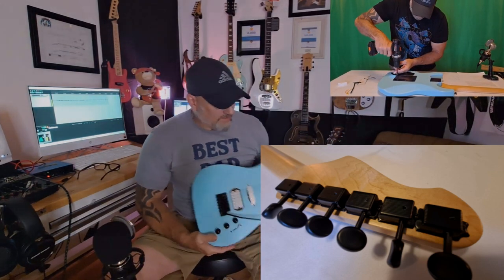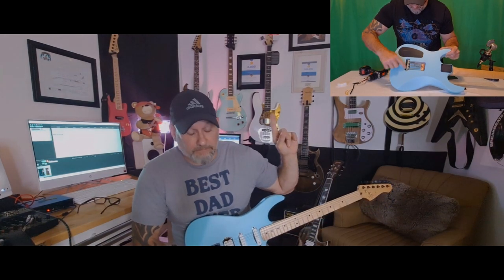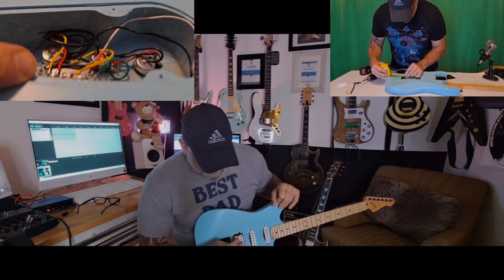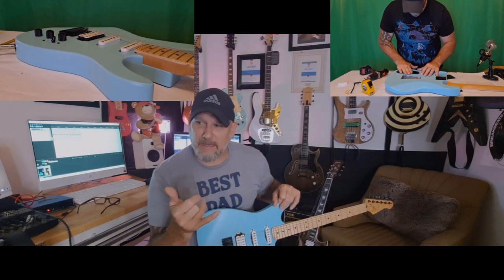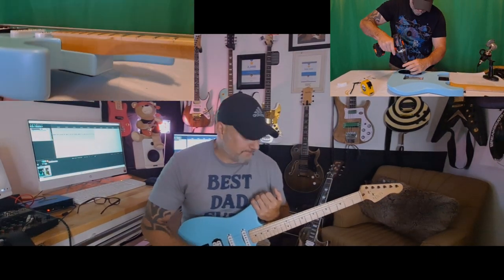Now let's talk about where they cut costs. The electronics aren't the greatest, though they're not the worst either — they don't sound bad. However, this unit had a wire off inside: a ground that was loose. I only had sound in four of five positions; the bridge pickup was completely dead. I got inside, quickly found a wire that had been poorly soldered. All the other soldering was good. It literally took as long as it took the iron to heat up — touch it back in — and it was in business.